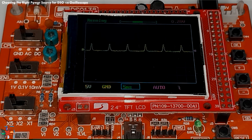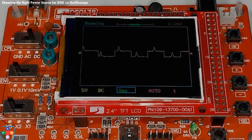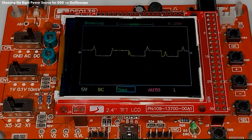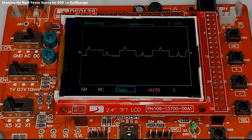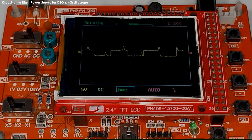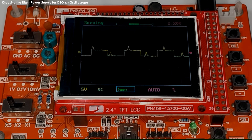As we can see, there are a lot of spikes. Those spikes are called interference — they are an undesirable byproduct of the inner workings of the power adapter. Now let's see how that interference influences the signal. Let's attach our probe to a signal generator and set it to generate a square signal. From the oscilloscope calibration video, we know that an ideal square signal has sharp edges and straight vertical and horizontal lines — that is what we expect to see. Instead, our spikes have merged with the input signal, giving us a lot of spikes and interference on the screen. This is a direct result of poor quality of power supply output.